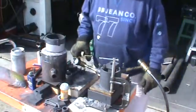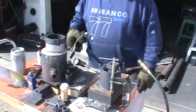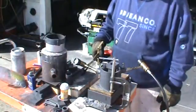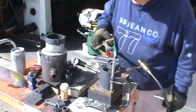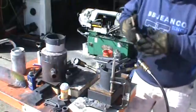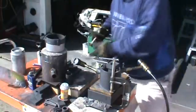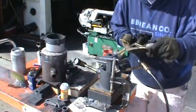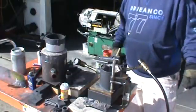That silver is still molten so I'm going to just let it sit a bit. These work really well in the bigger furnace I built, so I'm going to go ahead and buy the steel to make more — I think I'll be able to get 15 of them out of a piece of steel. The top of the mold is a lot cooler than the bottom of the mold, so I'm smart enough right now not to lift that out by the top. It is really hot, so I'll take a prodder — which is a spoon — and just pick that up and let it cool off a little bit.